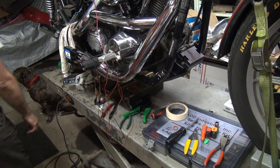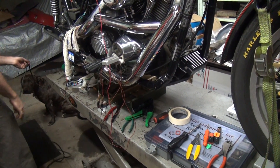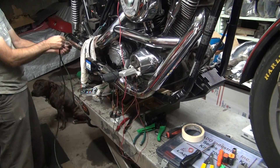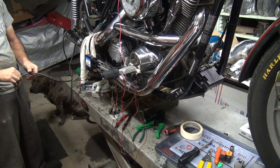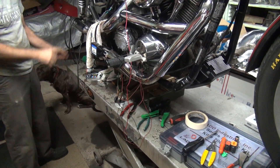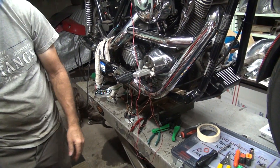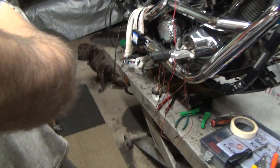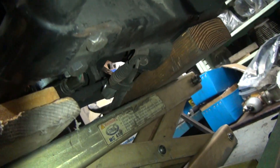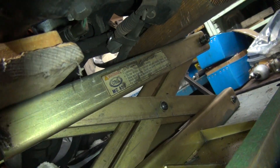So that means the whole time your stupid plug has been screwing with us. I wonder how long it's been that way because it was screwing up when you were riding the bike too. It acts like it just quit advancing - it would run but the timing wasn't advancing when you go down the road. Well, you didn't have the damn plug in there all the way or something. In case you don't know which plug we're talking about, I filmed that earlier when you had it out. It's buried up under there.